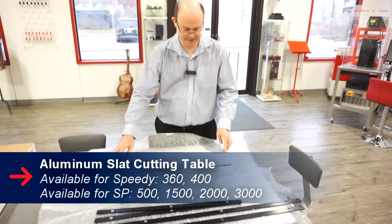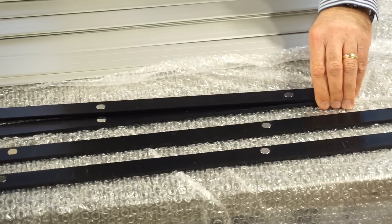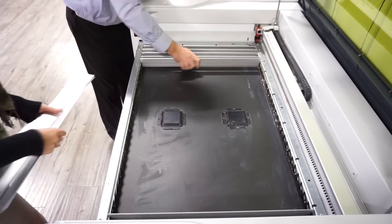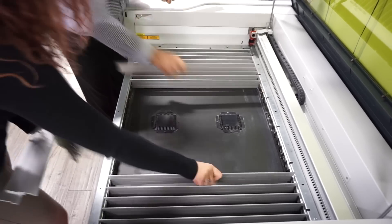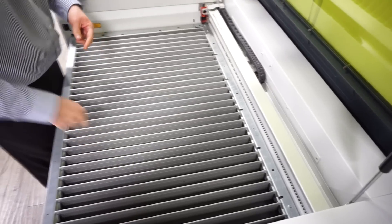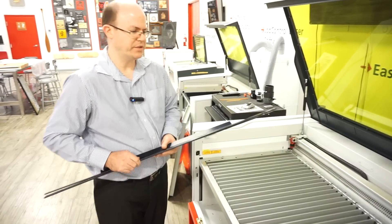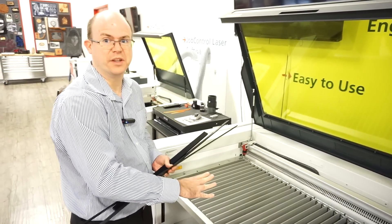This is the aluminum slat kit. There are slats that go in throughout the table to support the material, and the other bars are covers for the top, bottom, and sides so that you maintain a flat surface for vacuum flow. The slat table is primarily for cutting through thicker materials where you want to avoid bounce back. The vertical bars also allow for best exhaust flow as you're cutting. These are the border elements to bring the rest of the base frame up to the same level as the slats so you don't scratch the material when you put it into the table.